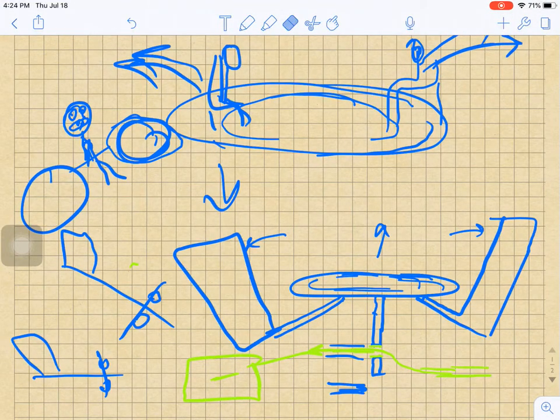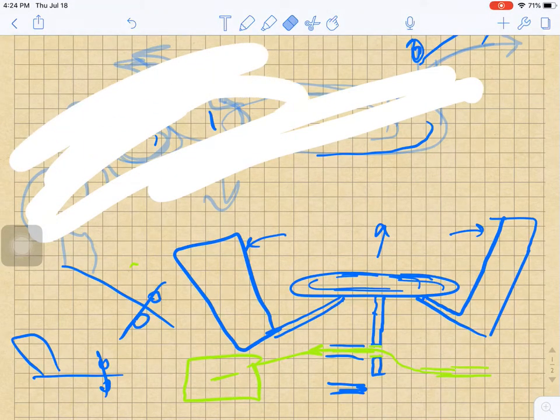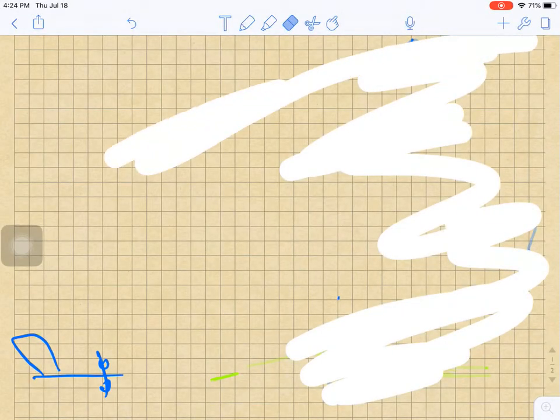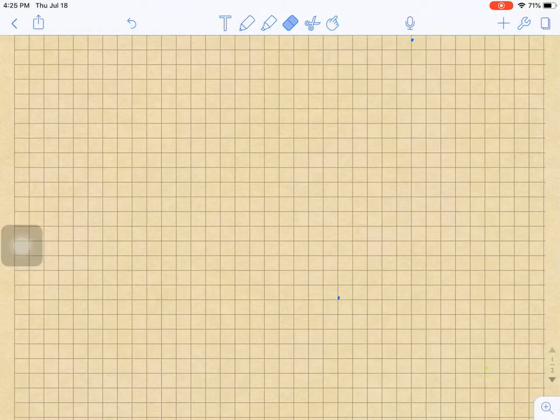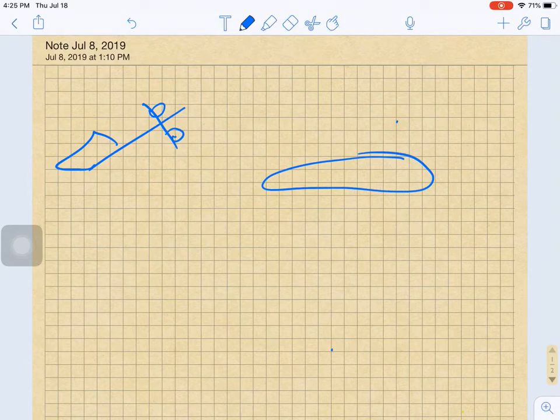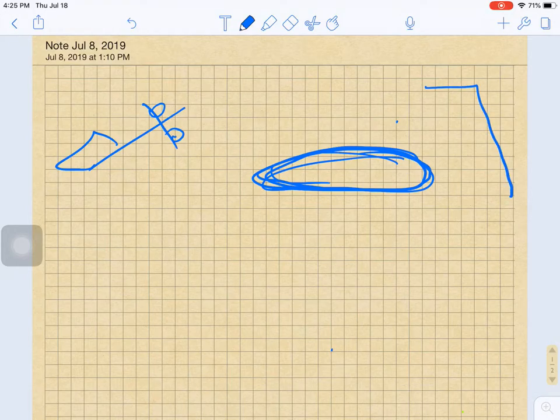Now we go back to the climb. So in climb, you're climbing this time with your Seminole, and this time the disc spins slower, gets slower and slower. What happens when it gets slower? Your flyweight changes its position.